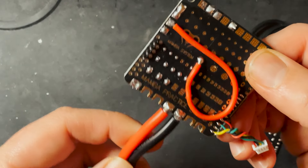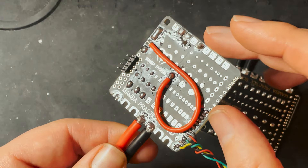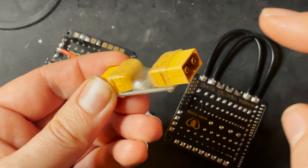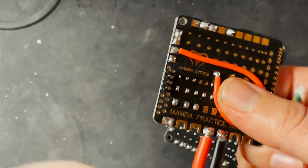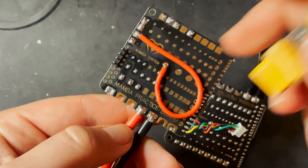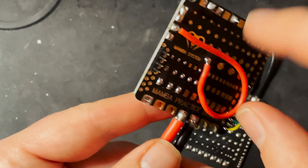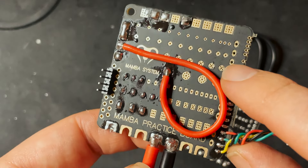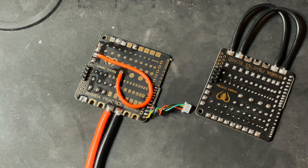Alright, I think that's going to do it for this video. Hopefully this helps you out if you're getting into soldering. Keep an eye out for bridge connections — if you have something like that you can ruin your entire flight controller. You can get things called smoke stoppers that plug in between the battery and the flight controller to prevent shorts from burning it up. Whenever you're doing soldering work, double-check your work, look for bridged pads, use a fine tip on tiny pads and a bigger tip on large pads. If this helped, make sure you subscribe — I do a lot of drone videos and drone builds. Thanks for watching.